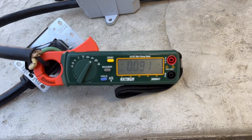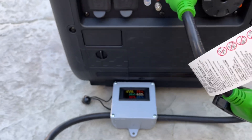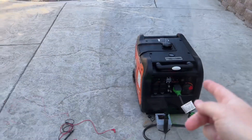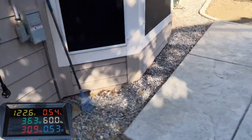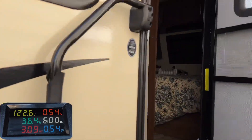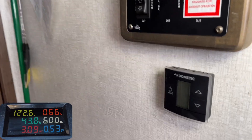I have a couple meters to verify. My more expensive meter runs about $400, but my cheaper meter sometimes gets off at lower loads. Everything is hooked up and I'm going to show you the watt meter live on screen as we add loads, so we can see how much I can actually get out of this generator on one hot leg.